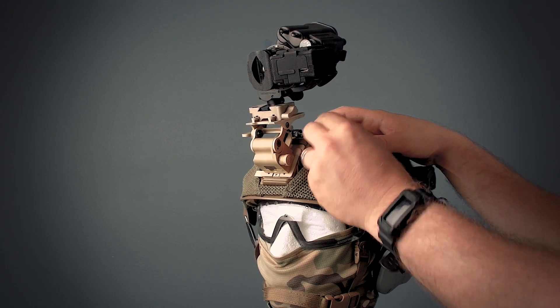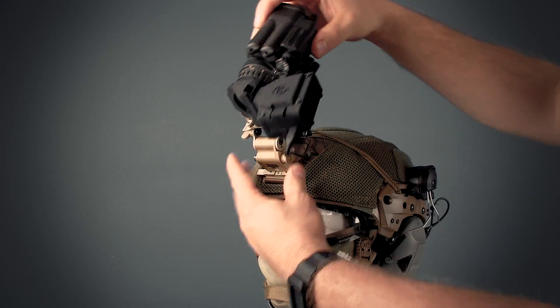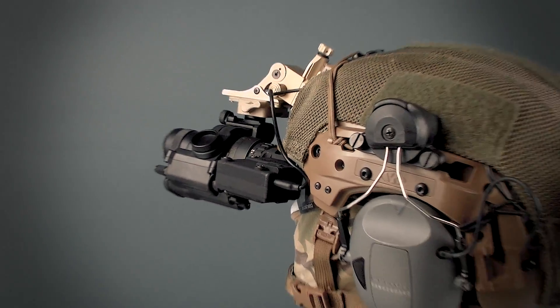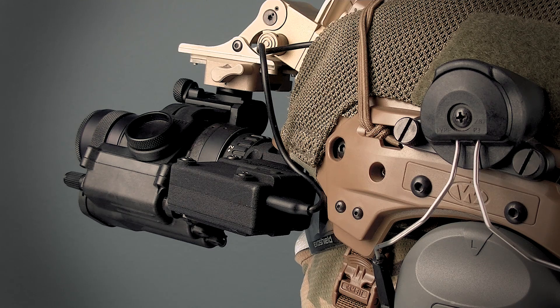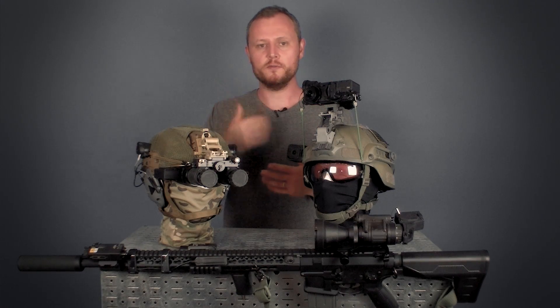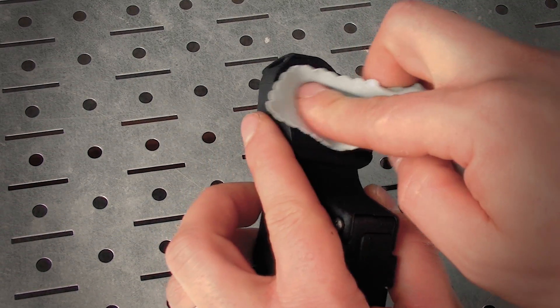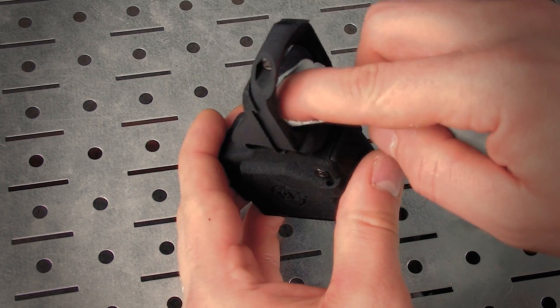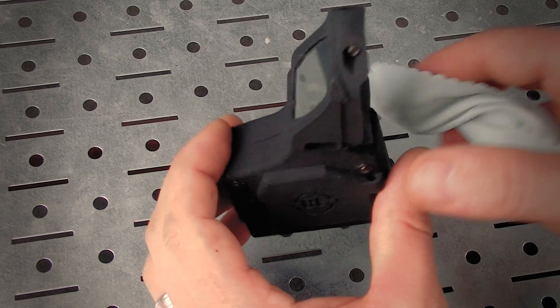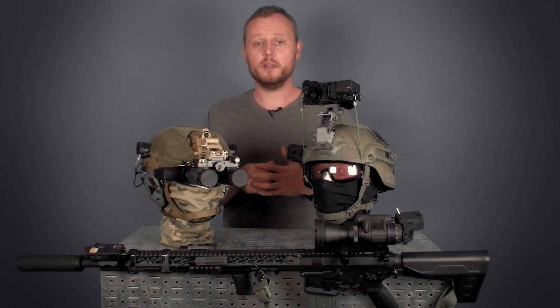You could power this camera externally — here I have a power bank on my back that I could run the wire to the back of the camera. I would recommend one of those coiled wires because there's a lot of stretching as the goggles go up and down, but with a coiled wire you could power this as long as your power bank lasts. The recording system is very durable. I've had absolutely no problems with either the camera or the glass, but it does require a little bit of maintenance. Make sure you clean off the glass — mostly for your own viewing since the inside is more protected from the elements. The external piece of glass can use a little wiping; make sure to use a non-abrasive, preferably a microfiber cloth to keep it all clean.